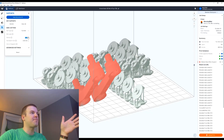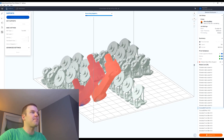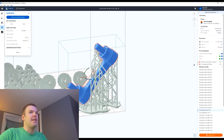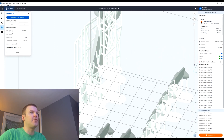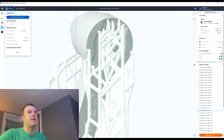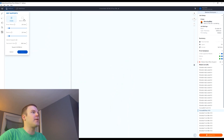The first thing I do is go to the top left — the default I think is 1, and I drop it down to 0.9. This is very dependent on the resin; you can go much lower depending on the specific resin. The touch point size default I think is 0.7 and I only go down to 0.65 because I'm using fewer supports and still want a decent size — most of my parts for durable are quite large. If I click auto-generate you can see it creates quite a lot of supports, way more than we need, including going up on the inside of my model.